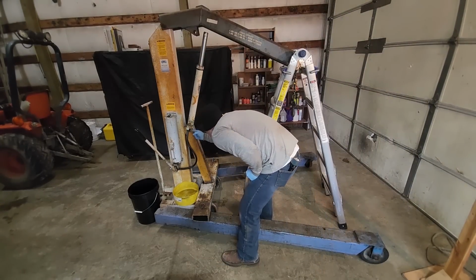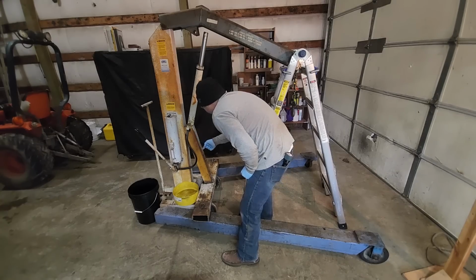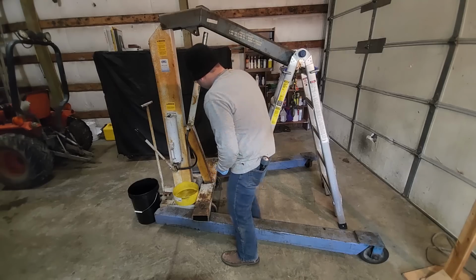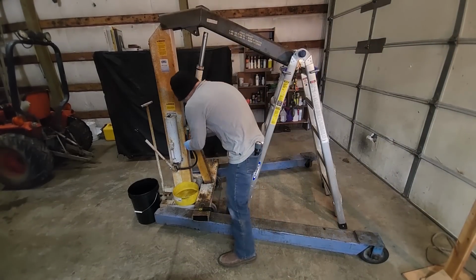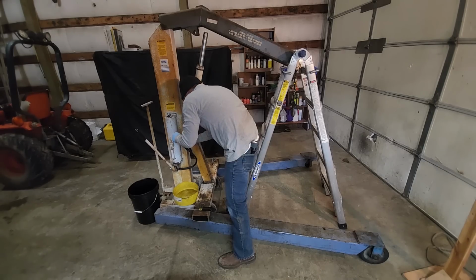So this one, obviously, the pin can't go this way. I mean, I guess it could if you took these fittings off. So what we're going to do is remove this E-clip and pull the pin out that way. I'm going to get a cap for this. This one looks about right. This is some of the most hydraulic work I've done as a Cat mechanic. It's kind of funny because obviously that's what Cat mechanics are known for, but I'm an engine guy.